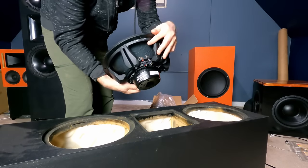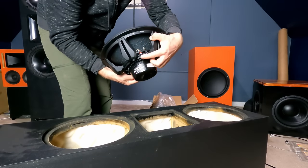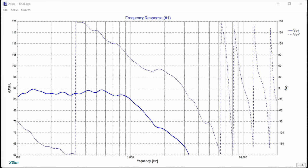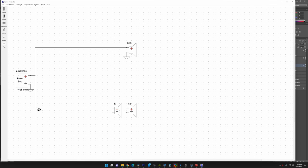I took all my measurements with my Dayton Omni mic and started designing the crossover. First I worked on the woofer — I was trying to get away with a second order, but honestly the third order really made a big difference. So I did a third-order crossover on the pair of woofers, which is atypical for me. The woofers are wired in parallel, meaning they go from an 8-ohm load to a 4-ohm load, making this a nominal 4-ohm speaker. Having said that, it's a very easy nominal 4-ohm load to push — I've run this with just my surround sound receiver with no issues.